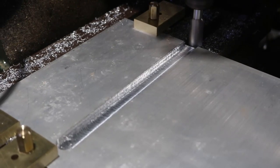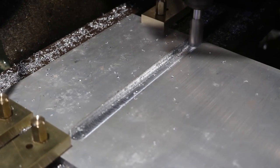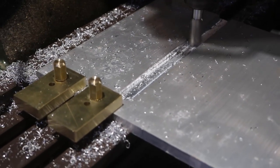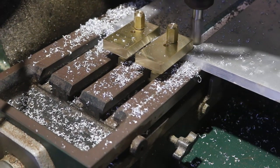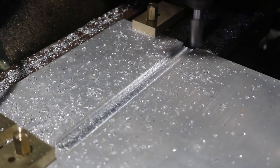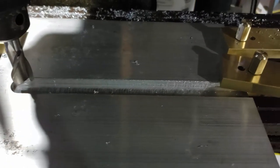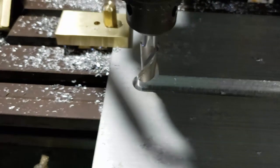There's the first pass — it's doing exactly what I wanted. I need to bring this down to half the plate thickness: a quarter inch attaching to the bar and the other quarter inch just for keeping it solid. I've gotten pretty close and I'm going to do another quick pass. You'll notice the clamp on the left near the bottom of the screen — I can't go all the way through because at that point I wasn't entirely certain whether two clamps was going to hold this rigid enough. I left that on there, and once I've done this pass I have to start machining the other side too. I'll switch the clamp to the other side and finish that off.